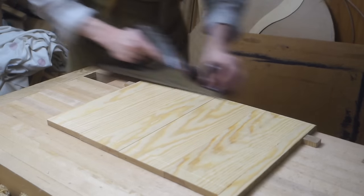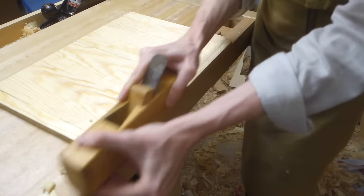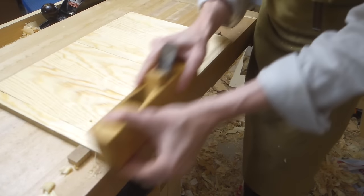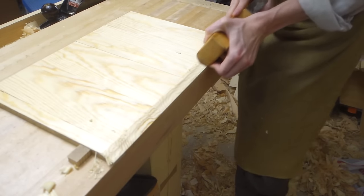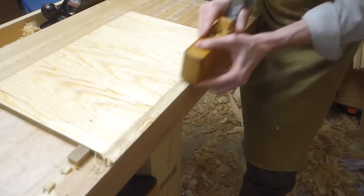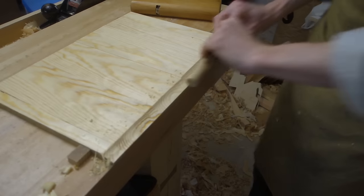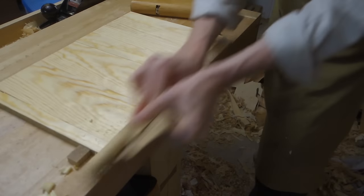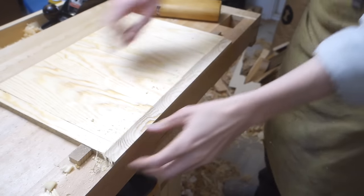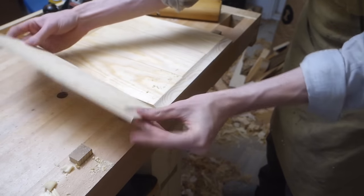Notice that there is a cutoff from the panels used as a sacrificial piece when planing across the grain, to stop the splintering when the blade exits the wood. I also sanded this with some 100 grit wrapped around a dowel, as I wasn't getting a perfect surface on this cross-grain cut. After the ends were done, I did the long sides.